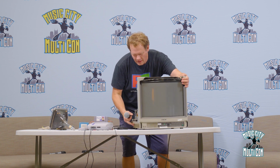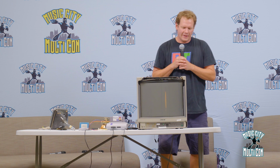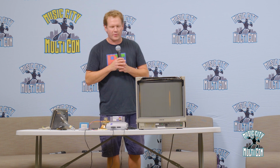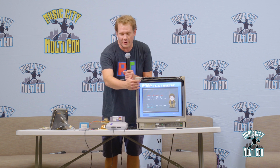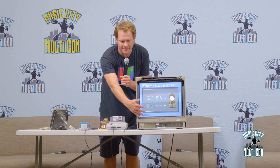the reason, again, these are so desirable is the video signal itself from the older devices is actually a lower resolution than most modern devices will even be able to handle or properly interpret. So what I mean by that is this is running in the old school, either 480i, interlaced, that's when I say I, that's another acronym, interlaced video, or if we're going down even lower than that, in video games we're going to 240p, which is just 240 lines on the screen of progressive